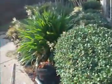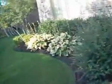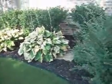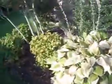These bushes are too close to the building, too many of them. Bushes actually transpire a lot of water, and water being removed from the grade next to the building and the foundation can lead to foundation issues. Again, you see the grade is too high here, it's touching bricks.